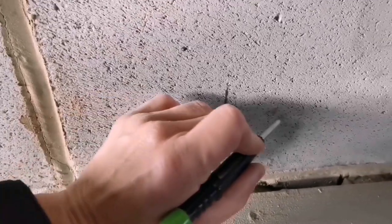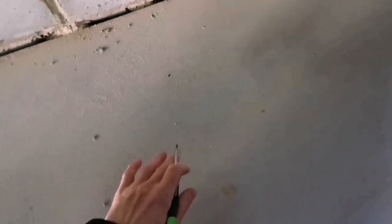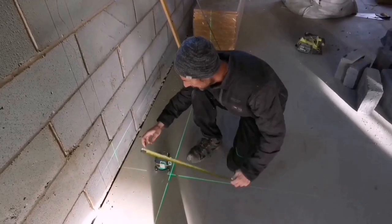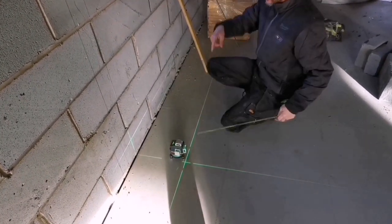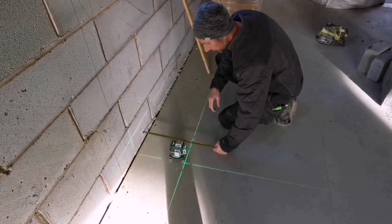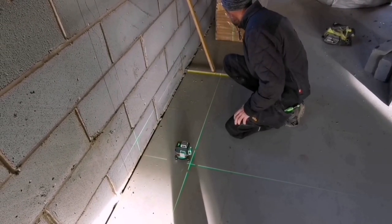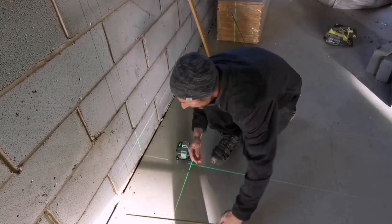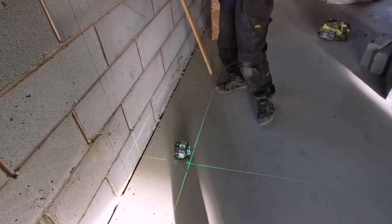So that's where this beam is — we've got a three-inch piece of wood and then we can cut out here and here. I'm going to square off the wall so we'll be able to cut it out. You can actually use the laser for squaring up with these 360 lasers — I've got my line set where I want it here and I'm just measuring off to get it right. Three, five — yeah, that's it, so we know that's square. So that's the line, we'll draw that on.